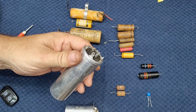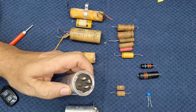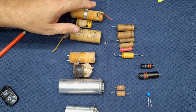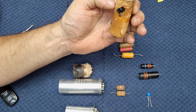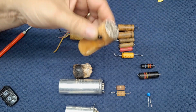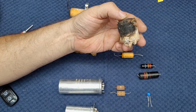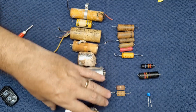They go bad — there's no doubt about it. They dry out, they short. They are another number one cause of problems in radios. They must be replaced — all of your electrolytics must be replaced. And this is looking inside one of these here — all it is is tinfoil separated by paper, all wound up, and they short. Here's the result of one that shorted — you can see it's quite burnt. That's what's happened. So we need to change them all out.